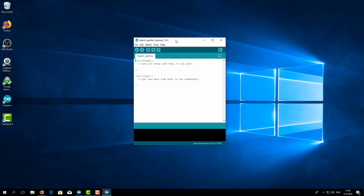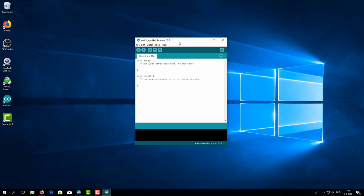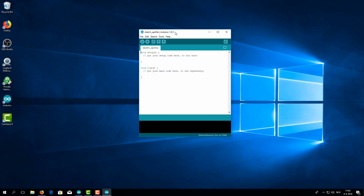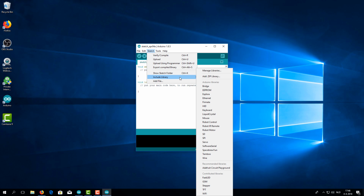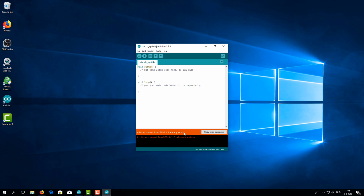So the first thing you do is go to the Arduino website and download their software. This is free to use, and the link is down in the description. And what you also need to download is the FastLED library, because that's a basis for FastLED programming, as the name implies, and we need to import that library into here. The link for the FastLED library is also in the description, and once you have both, install the Arduino software, and then you go to Sketch, include library, add .zip library, and mine is in the downloads folder. Come on, downloads folder, and then the fastled.zip, and open, and it'll say it already exists because I already did that.